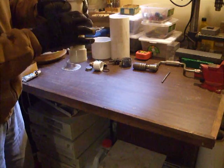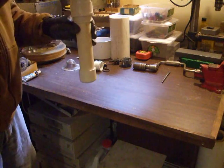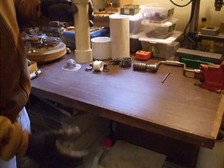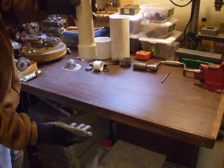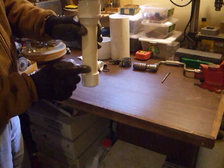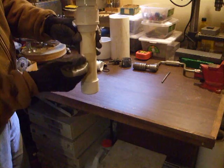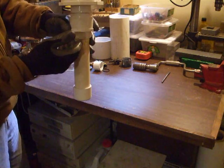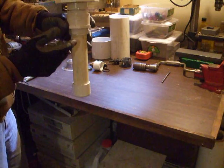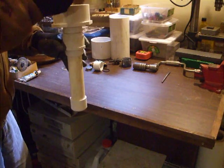What it does is, there will be holes in this pipe here, holes down here. As water comes in here, it just goes in there and fills up the barrel. When the barrel fills up, the water comes up like this. And as soon as it reaches here, it starts inside this pipe, filling the pipe. And that makes the ping pong ball float. It floats up as the water fills. When it gets to right here inside there, it seals. And this fills up, and the fresh water flows out.